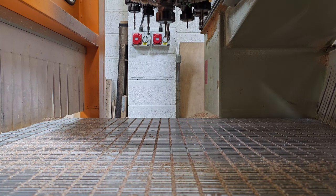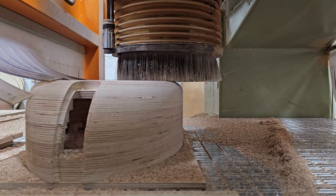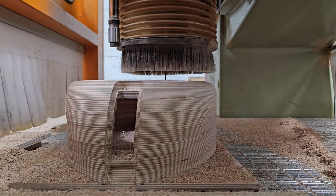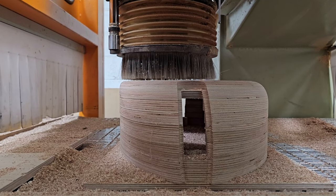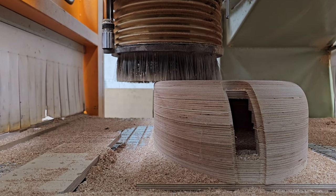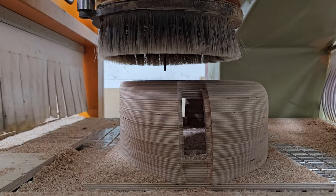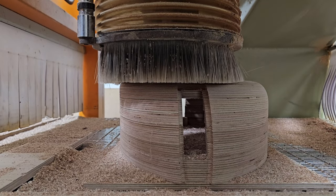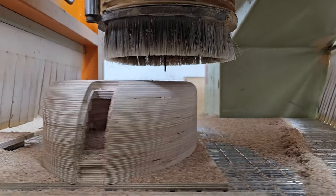So this is a 5mm dowel drill that it's changed over to, because I only had a 5mm left over. And this gets a little bit close and you can't see it. Yeah, it was scary the first time we did that. I realised I didn't have enough length on my drill because all my drills are set up for drilling through 18mm. And this is through 18mm, but like 15mm down in a rebate. So it pre-drills everything with a 5mm drill, and then the only other long 8mm tool I had in here was a long 8mm ball nose.